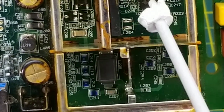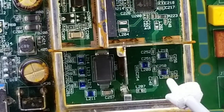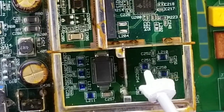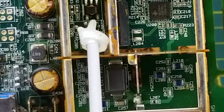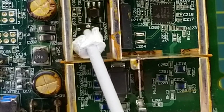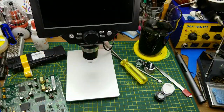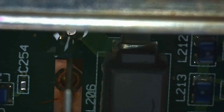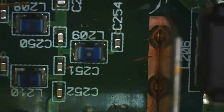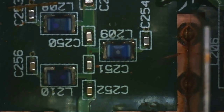We have two different sections in here — one will be transmit, one will be receive — onto the cable at different frequencies, because the uplink and downlink on a cable TV plant operate at significantly different frequencies. There's a little chip in there with what looks like a TI logo and a crystal. In the other section there's probably a transformer and a handful of passives. Using a closer lens, you can get a better look at the RF input section with all its inductors — that combining and filtering covers both the receive and transmit sections going out to the connector.